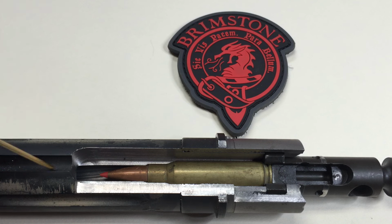And so what I do when I'm resizing my brass is I'll unscrew the sizing die and have it way long, and then I'll just slowly start turning it down while running the cartridge up in there. And you'll turn it a little bit, run the brass up, take it out, look at it, and you'll start to see a line appear on here where it's just necking down the neck. It's making the neck smaller. And you just gradually turn it down and you'll watch that line run down, and I get it so that it just touches the shoulder and stop.